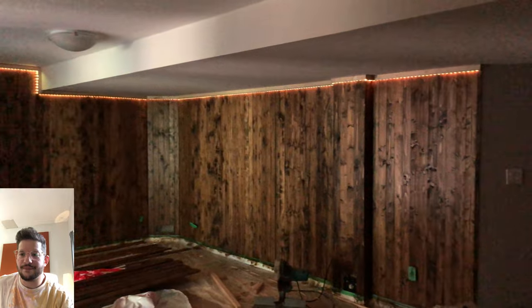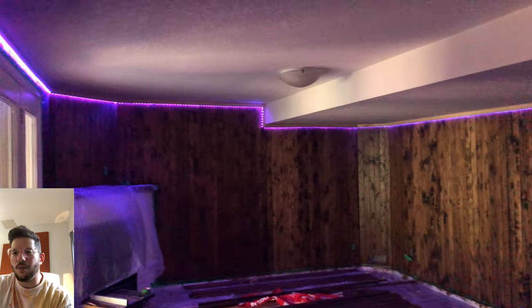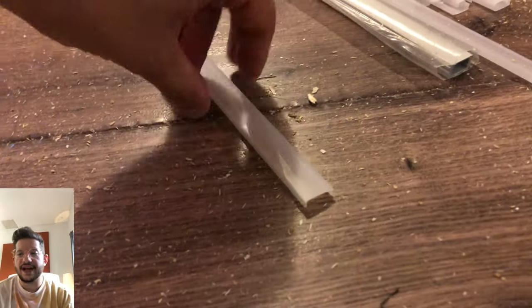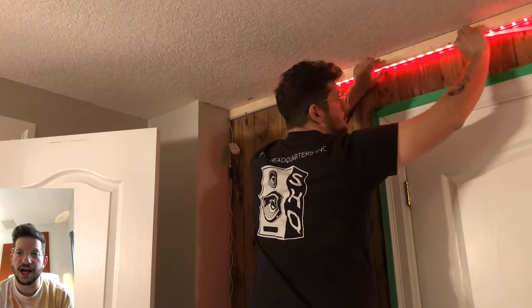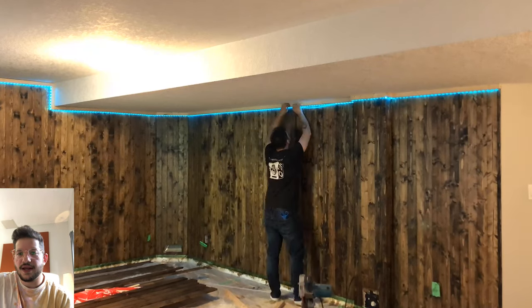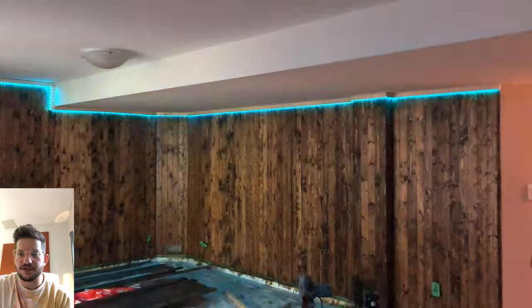This is without the trim piece covering it up — once we add that trim piece it's going to direct the light more downwards onto the wall, which is what the client wanted: nice ambient-style lighting within the live room. You're going to see how these lights illuminate the panels once they're installed later in the video. This is the light diffuser — a milky white plastic that clips into the aluminum channel. This helps get rid of those little visible dots from the LED. It just presses right into the channel. You can see the difference between where the diffuser is and where it's just the raw LED strip. This small touch diffuses the light and makes it look more consistent. I can cut it to size with scissors and miter cut it on 45 degrees wherever needed, then press it into the aluminum channel.